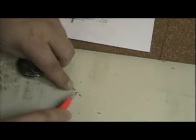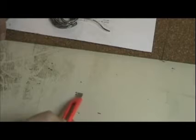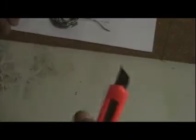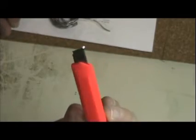And you can probably see what I've got here, these little discs. Let's see if I can stick one on the end of this. Come on, behave. I'm probably going to have to get a picture, but you kind of see what I mean. You've got this little disc here, and a whole bunch of them. You're going to need a fair amount. Like I say, probably about a 32nd of an inch, and I've got a bunch of them already cut in this little holder there. Okay, now we're ready to solder the stock rail on.